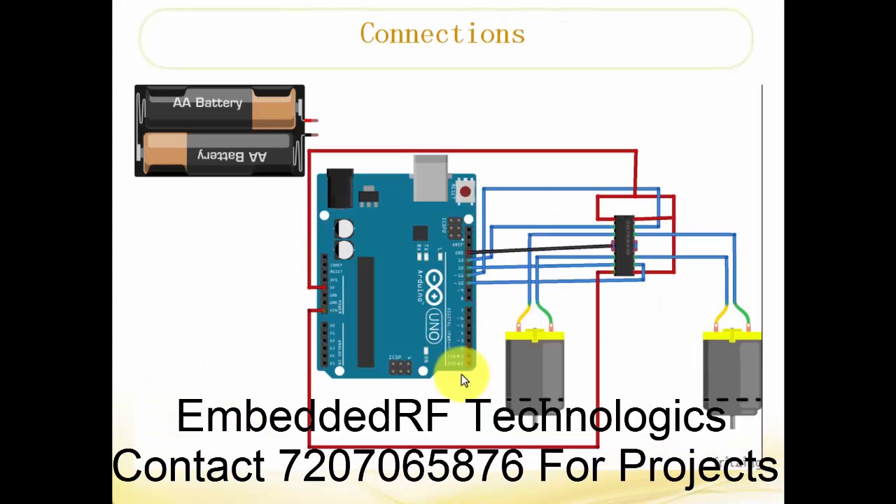This is the basic connection as shown in the diagram. This IC input is connected to pin number 13, and another input for the second motor is given to pin 11. The four inputs are pins 13, 12, 11, and 10. These are the grounds connected here, and the 5-volt lines are connected here — everything on this side is connected to 5 volts. To power this I require a small battery, which provides the power supply. In my next video I will be covering the coding, which will be done through this USB cable.